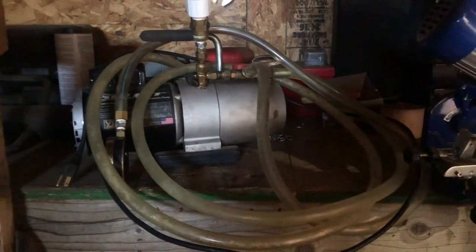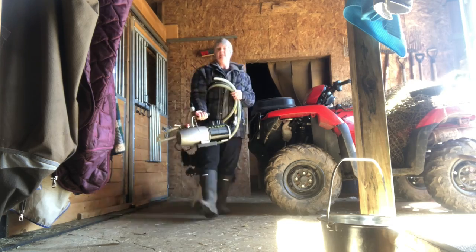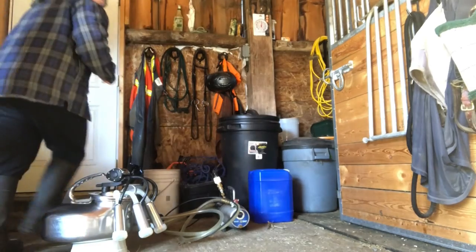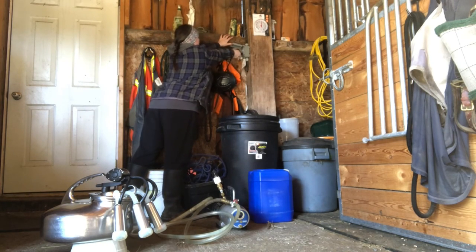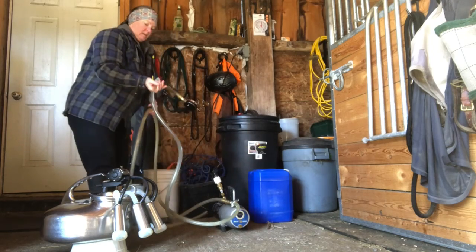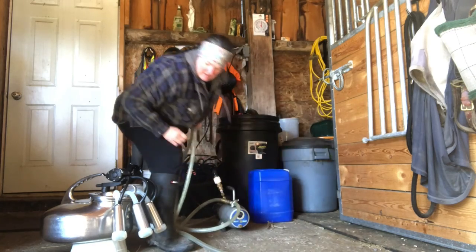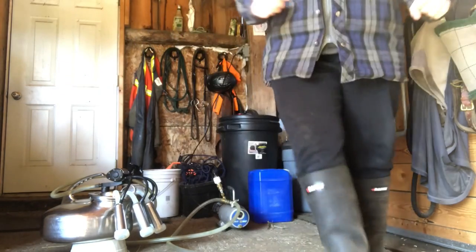Now I've got to go and grab the pump. We have a small portable pump and we just store it out here when the weather's warm enough. I'm going to need two hands to grab this because this sucker is heavy. The next thing we need to do is plug it in — we have a little plug there on the wall. There's a little cap that goes on the filter that I've just removed, and then there's our pressure gauge. This hose hooks into the milking machine and that's what gives us our vacuum.